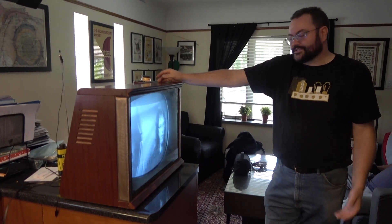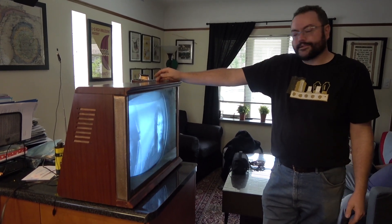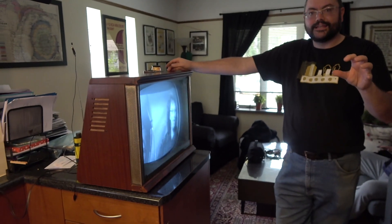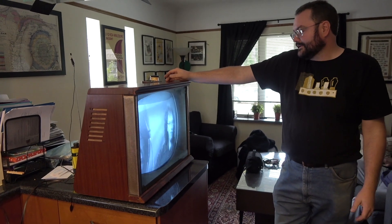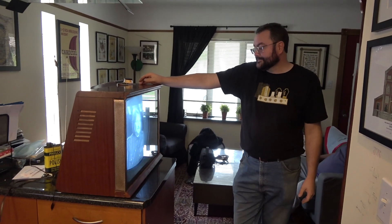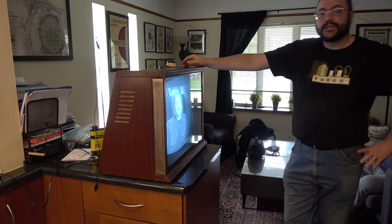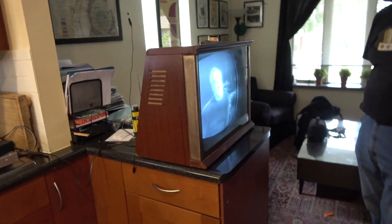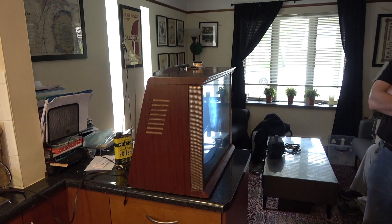Jason came to the rescue with a new flyback, so we got that in there — that got it up and running. I had some other headaches to deal with along the way. Two of them were caused by my own mistakes: I used the wrong resistor because I didn't read the color band right, so I was chasing my tail with that for a little while. But once we got all that figured out, it was more just getting it dialed in. It looks really good. And like you mentioned, Jason Neal — another collaborator of ours — he sent a flyback in the midnight hour for us when we really needed it.